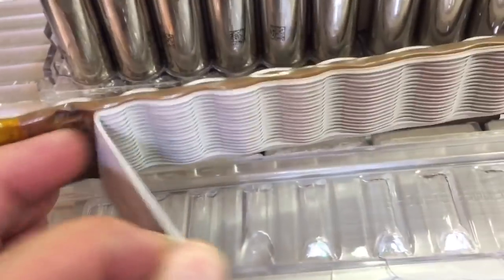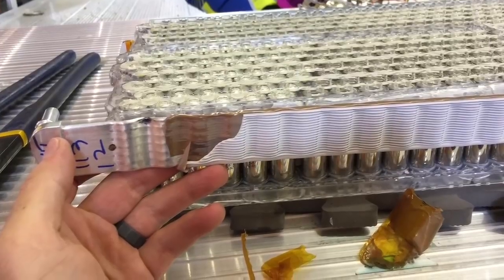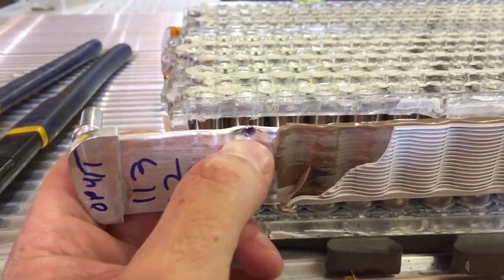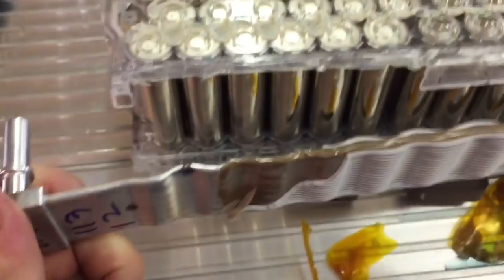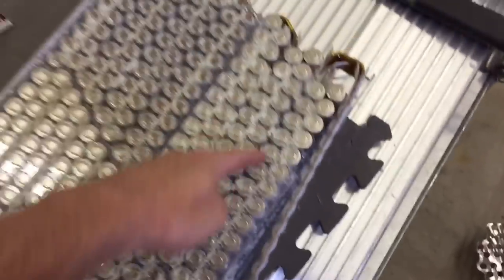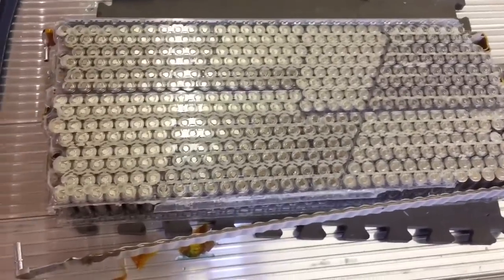Each side is coated in corrugated rubber, and inside is the actual aluminum — or possibly copper — piping. It was held in place by a corrugated spacer to help push the ribbons down in between the cells. I was expecting to see this transition into a series of about five or six individual tiny tubes, but in fact it's really just a hollow ribbon — quite a piece of engineering and manufacturing. Fluid can flow through this micro channel that runs the full length — about two feet each pass, zigzagging back and forth perhaps 16 or 18 feet of cooling total.